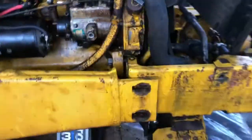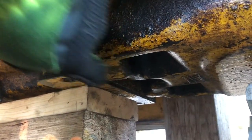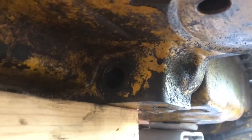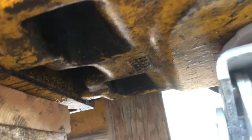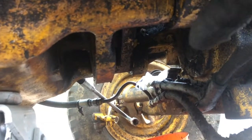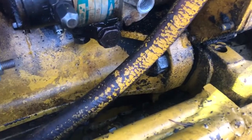A lot of this stuff I'm putting the box-end wrench on and then smacking it with a big chunk of wood. You've got to support your pan because it's big heavy cast. There are two more bolts in the back - the bolt comes in from the back side, all the way through, with just exposed nuts on this end. They're inch-and-an-eighth big nuts, one there and one on the other side, same thing up front. The two on the bottom go into the oil pan, and the four above are going into the block.